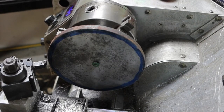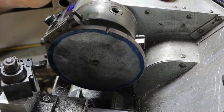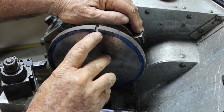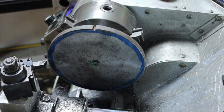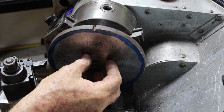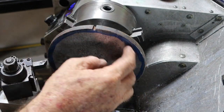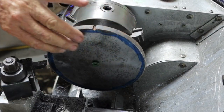This is the plate I'm going to use as my indexing plate. It's got a notch in the side but luckily it's just bigger than 6 inches or 150mm, and the center-pop marking from when it was cut out comes right to the bottom of that notch — lucky, otherwise I'd have to weld it up. I don't want to machine the outside of this yet — I'll do that after. The slug that it's bolted to will end up fixed in the center and bored out. But before all that, I want to drill the 36 holes in here. First I want to face off one side — it's a bit rough with pockmarks and some rust.